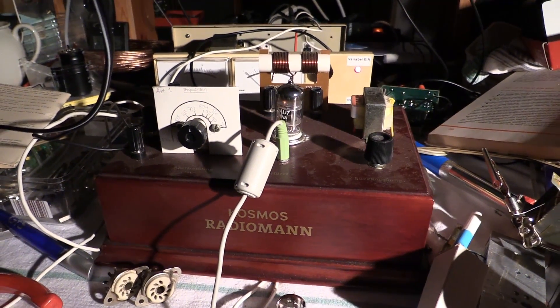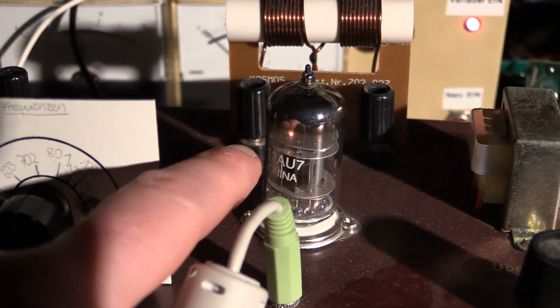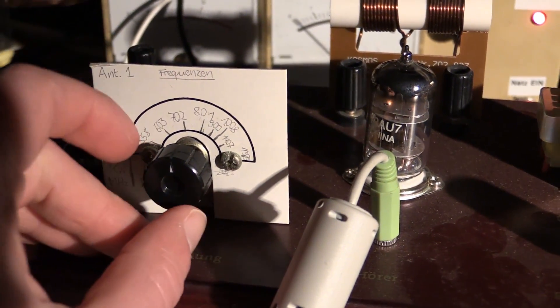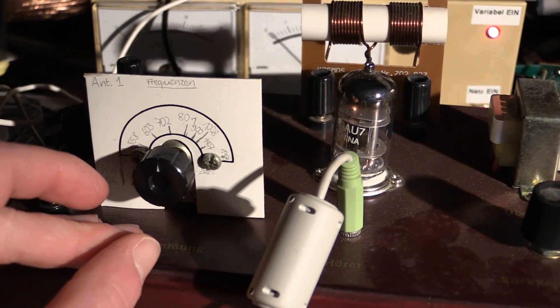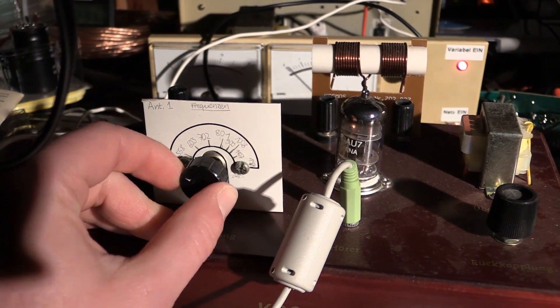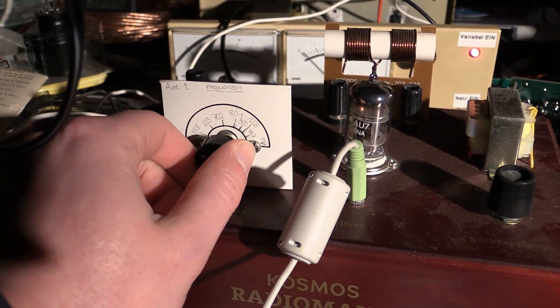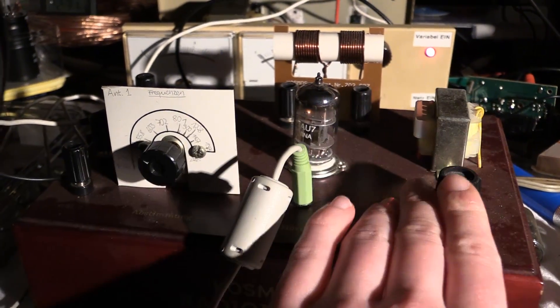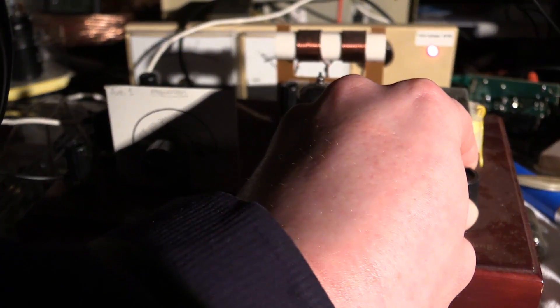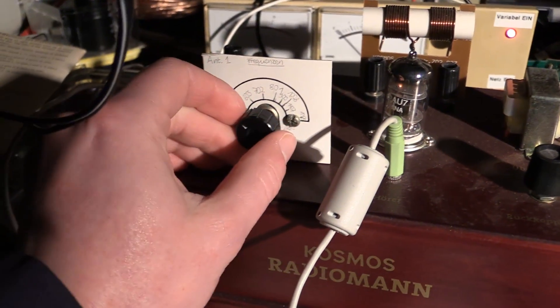The speaker has turned on. As you can see, the tube is glowing quite happily — that's looking quite nice. It's picking up some interference from the camcorder as well. As we go all the way down it's quite hard to tune this, because it's just directly coupled to the tuning capacitor. I'm going to take the feedback out a little bit, because if you turn it up too far it's just going to distort. This is maximum volume — it won't go any higher.